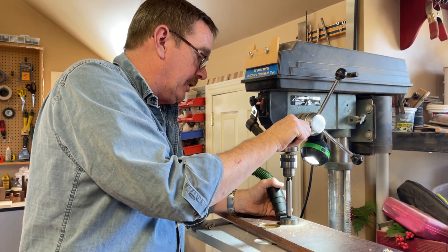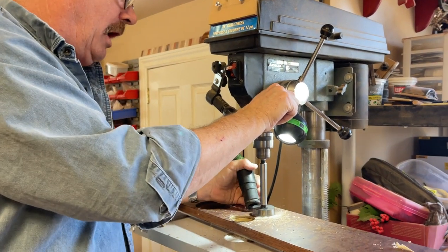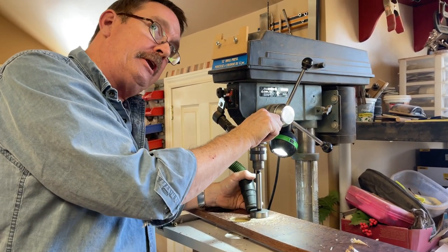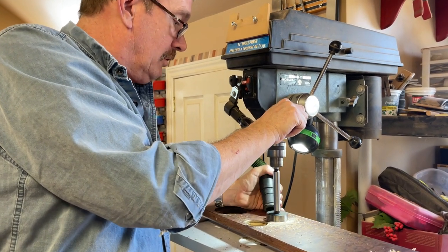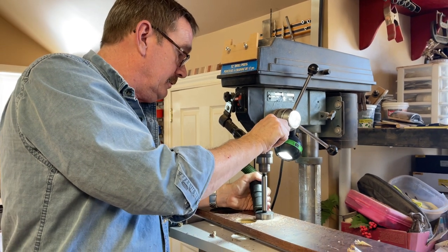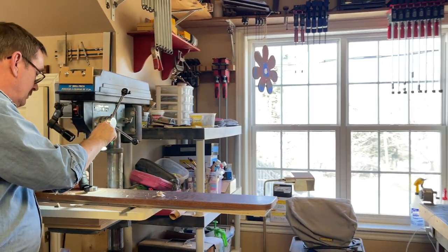I just find it simpler. Well, this is the easiest way. One piece of wood, polish it, cut the holes in. It's not polished yet, but the veneer is stabilized with some finish on it, and then I'll sand it all down again and hit it again with more finish. Otherwise you have polish and stuff inside the holes, and the one board is much better, I would think, by far.